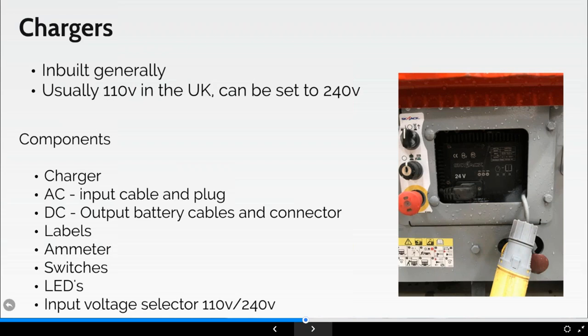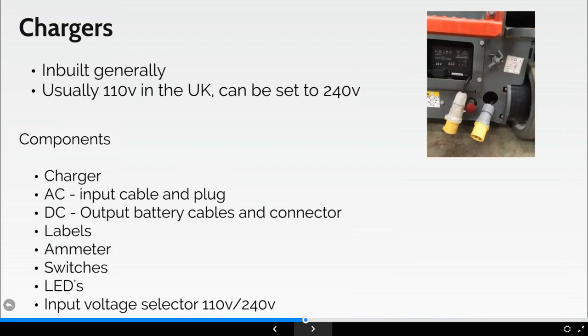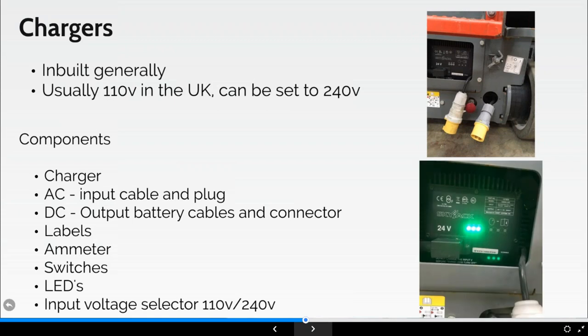Any operator who's had a long, perhaps busy weekend, perhaps not self-aware, mind not on the job, may not even charge the machine itself, okay? And if we now look at the two sockets here, you can see these two sockets there. They are virtually identical, okay? One is for charging and one is for providing power in the platform. So you plug the machine in and you wait for the charging lights to start their sequence of charging. It may equalize. Equally, no lights, no charge. What's wrong? I've plugged it into the wrong one. So you'll see some indication there.